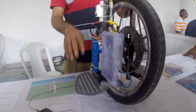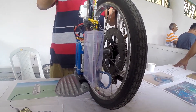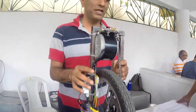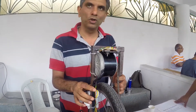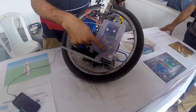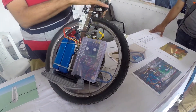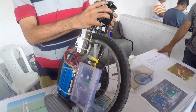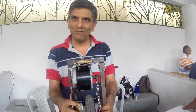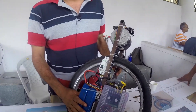You stand on these two pedals and it constantly detects your body position. If you just lean forward even a degree or two, it detects that and starts moving forward. That's the Arduino on which the code is running, and that's the motor controller which controls the motor. It will never ever let you fall front or back.